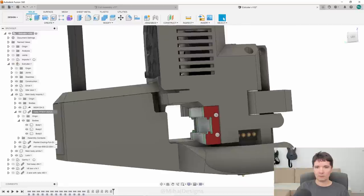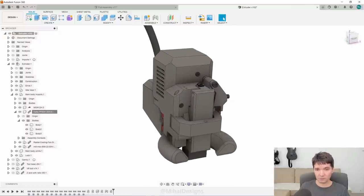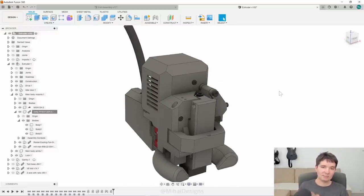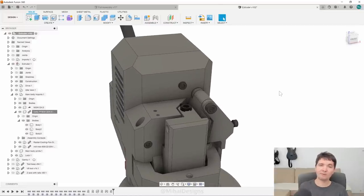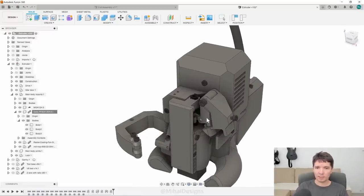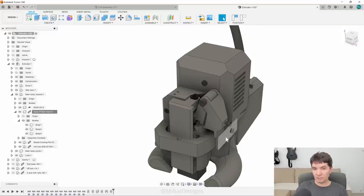At the back we've got a cable room with all the cables needed to run everything. What is also nice to have in a 3D printer are filament sensors. Some can detect if your filament runs out and stop printing until you replace it. Other sensors are more advanced and can check for clogs, jams, or filament stuck somewhere, and alert the user. In this early version I haven't had time to add any sensors, but there is designated room here to have both kinds.